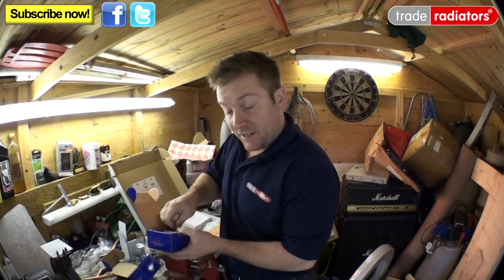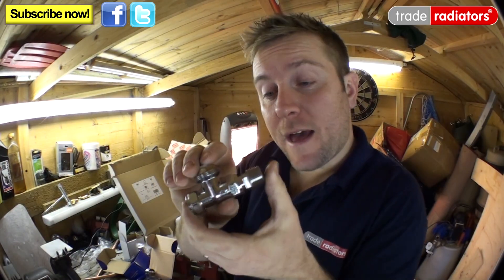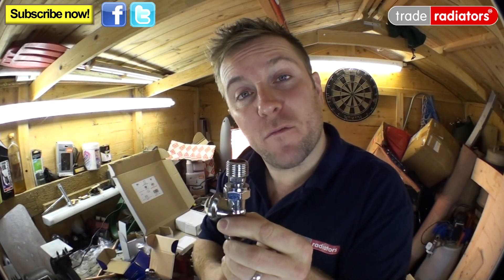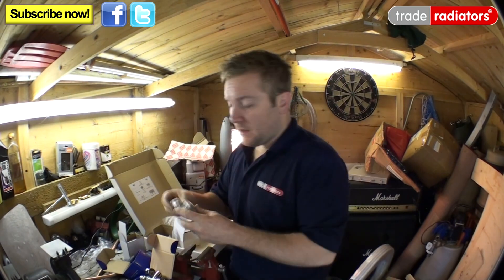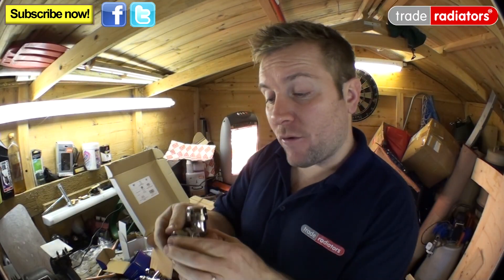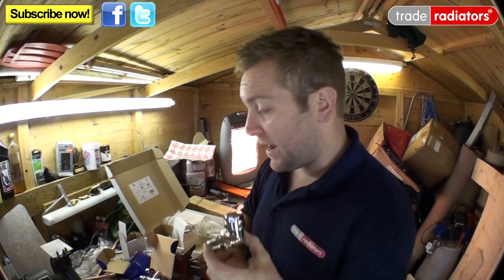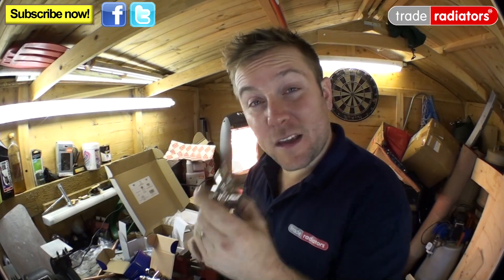There are loads of different types of thermostatic radiator valve on the market. You can get chrome-headed ones like the one we've just seen, and right-angled ones — otherwise known as a 90. You can also get straight TRVs where the body goes straight through; note that these only have one arrow on them, so the flow has to go through in the correct direction, meaning you'll need to know which is the flow through your radiator. These look great going up into the bottom of radiators or coming in at the side. And you can also get angled thermostatic radiator valves — if you have a radiator on the wall, you can have your pipe sticking out and going straight into the side of the radiator. These look really cool and neat for a new installation.